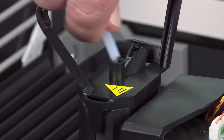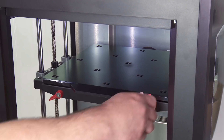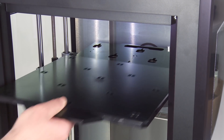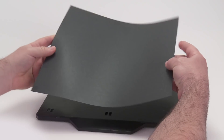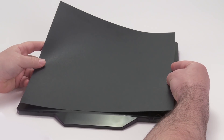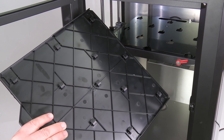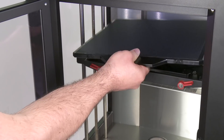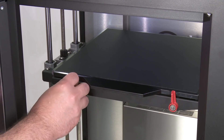To finish, insert the guide tube into the extruder. Next, we'll need to put the build plate tape on the removable plastic top plate. Simply peel off, align, and press down firmly. Fit the removable plastic top plate onto the aluminum base plate and snap it into place. Make sure to turn the build plate latches to lock it in.